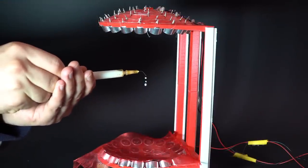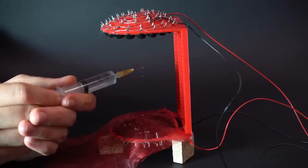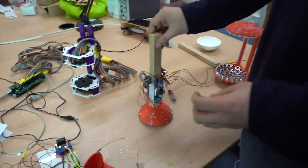But there are other practical reasons for perfecting levitation with sound. People are very familiar with magnetic levitation, and it's good because it's very strong, but it has a big limitation — the materials that you can levitate. They need to be ferromagnetic, diamagnetic, or paramagnetic. With acoustic levitation, you can levitate any sort of material. So it could be liquids, it could be powder, it could be electronic components, insects — basically you name it. Any material with a certain limit in density. So you want to be able to levitate any kinds of materials, although there is a limit with current technology in size and density of things that you can levitate.